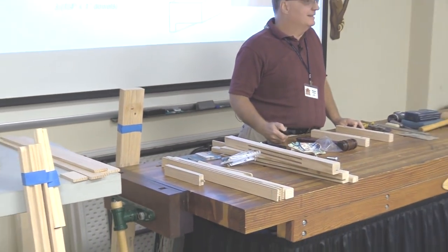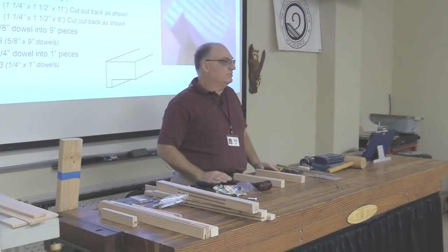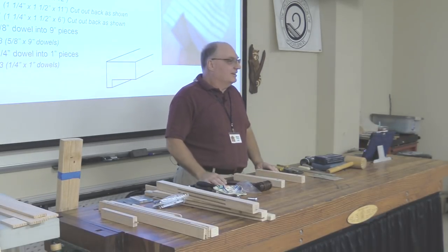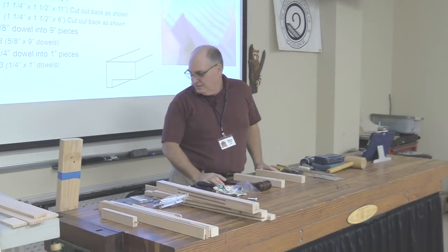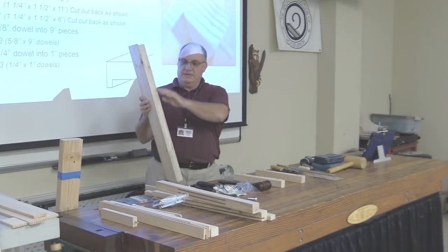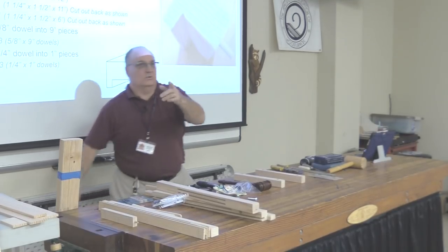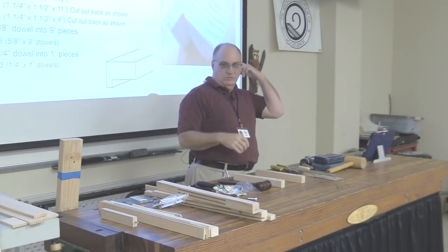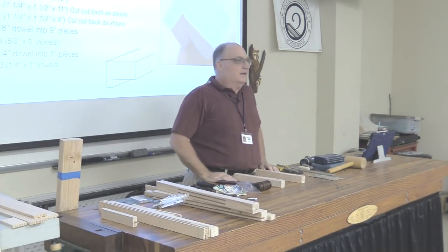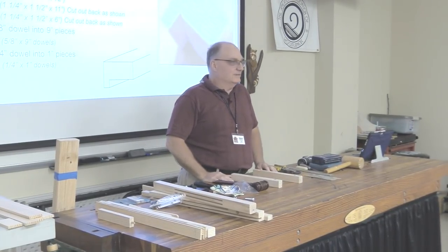Where did you find the fir lumber at? I pulled these out of a 2x4x8 rack at Home Depot. Whitewood. Yep, whatever is in there. I'd look for something that's fairly clear, but it doesn't have to be. It can have a few knots in it. I kind of like this one because it had the discoloration on it, and the one easel that's going around, you can see has a lot of discoloration on it. I like the bluish-grayish color. That one was an absolutely clear fir 2x4. How I found it, like I said, I don't go through a whole stack. I'll go through about 6-8 pieces, and that's it, pick the best one.